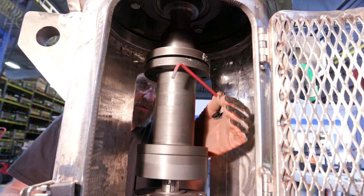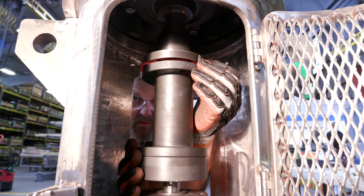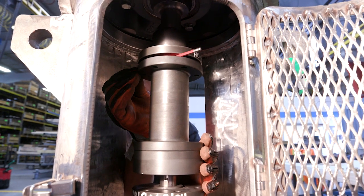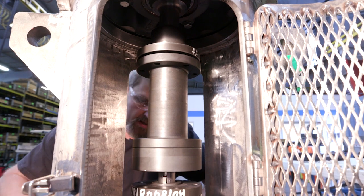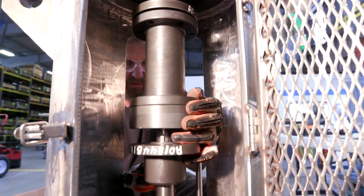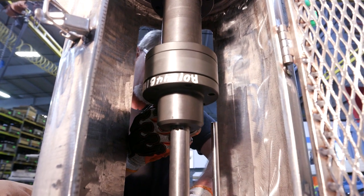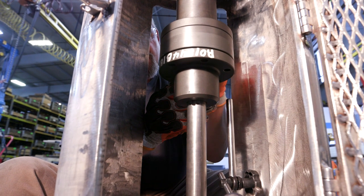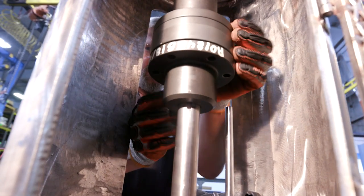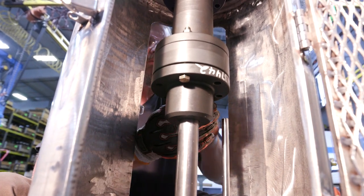Use a 3/16" Allen wrench — something typically in your bag — slide it in, hold down on the motor hub, and once it touches that is your lateral setting. Back that out, pull the Allen wrench out, and now insert the pump hub bolts. Two of these bolts will have standard nuts (not lock nuts) for adjustment purposes to check shaft run out. Install one bolt, turn 180 degrees, and install another so they are 180 degrees apart.